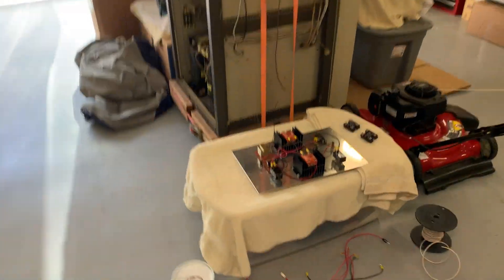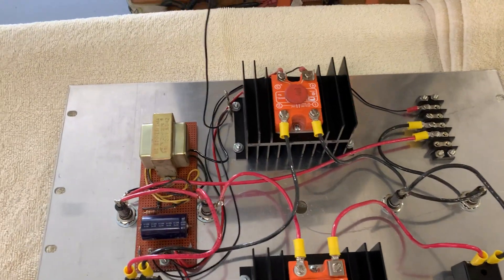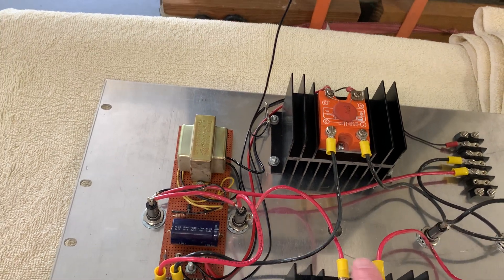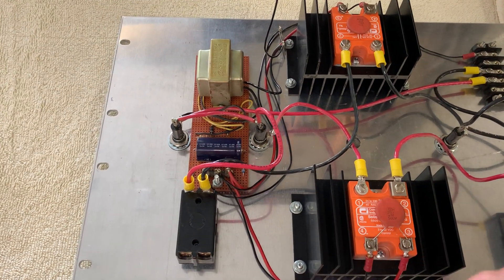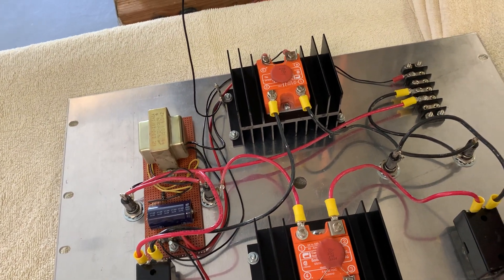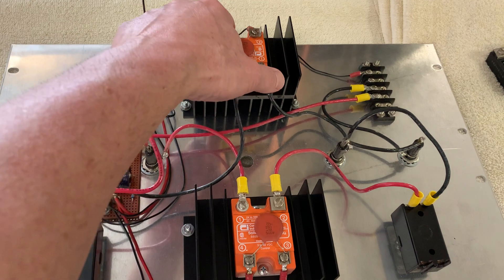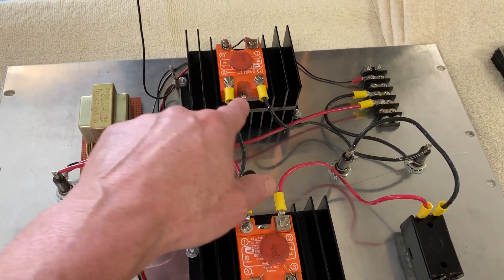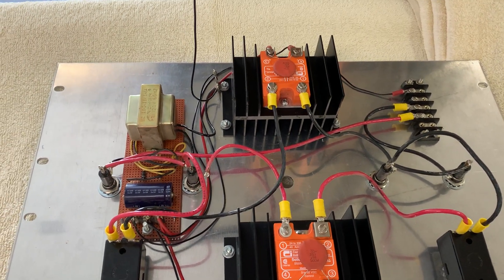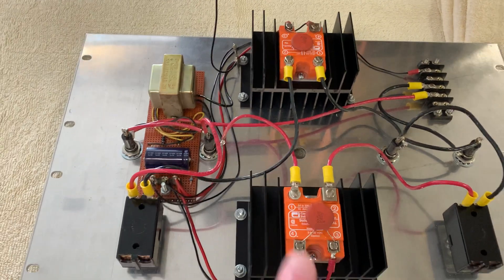Here's the power control panel at the bottom of the transmitter — there are the relays. I had one in series with the black and the other in series with the red. These were hooked up differently before, but I think the issue is because when I clip the voltmeter to the neutral and touch either contact, both of these — no matter what I do — just read as a short. It's because I'm going from reference to that neutral lead.